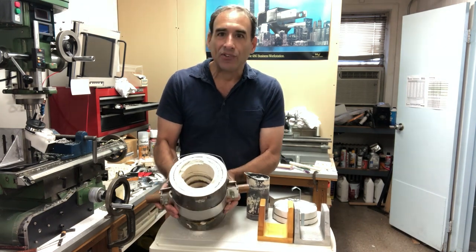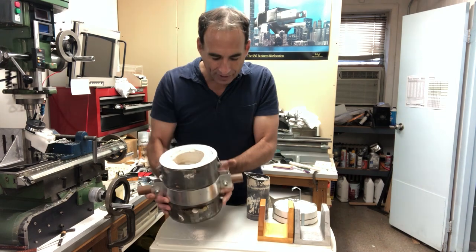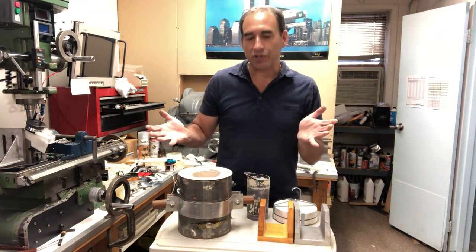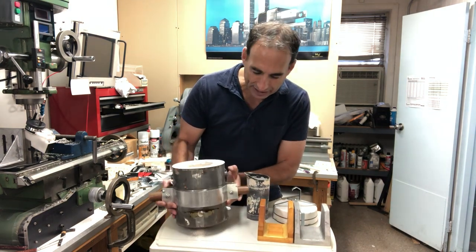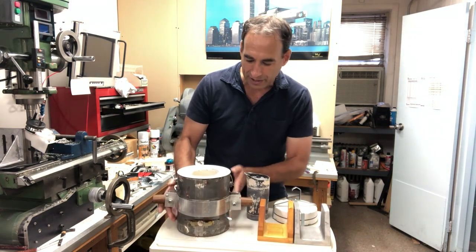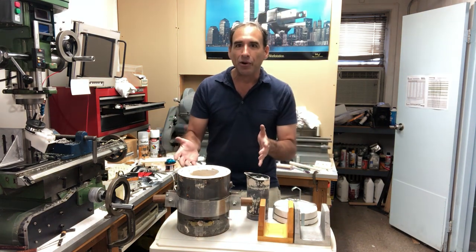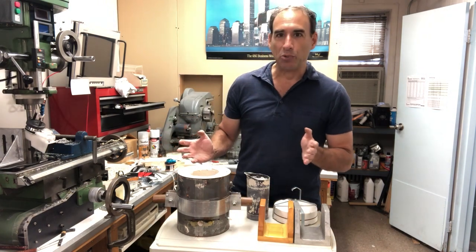You can see that there's a nichrome coil inside the furnace. At first I started firing the furnace electrically, but then later I drilled a hole and was able to fire the furnace with propane. I'd be able to get a lot more power going into the furnace and could melt my aluminum more quickly.